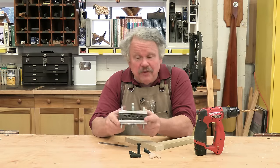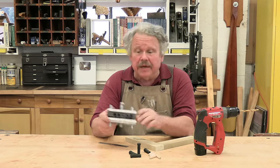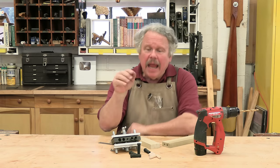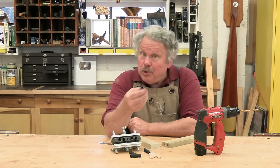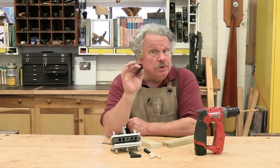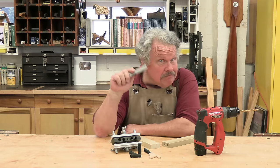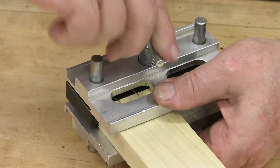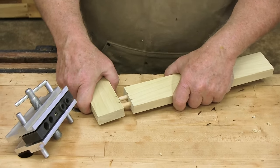This is a self-centering doweling jig. It's available at hardware stores, home centers, online — I've put a link in the description. It's made to create doweling joints like these and it comes with interchangeable drilling guides so that you can use it with quarter inch up to half inch in diameter dowels — that's six millimeters up to 13 millimeters for those of you who don't share the same preoccupation with fractions that I do. It's wonderfully accurate in both imperial and metric. Just mark where you want the dowels on the adjoining boards, line up the jig with the marks on each board and drill two holes. The dowels will line up perfectly every time.